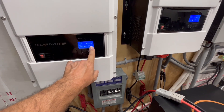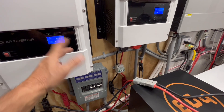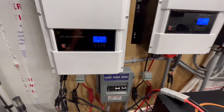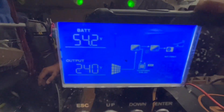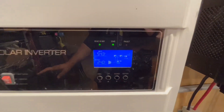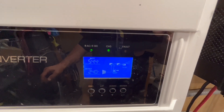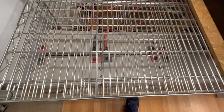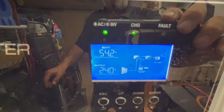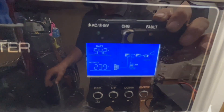It'll take a few seconds — maybe five or six — and the fault code will clear. The next time it starts up, it'll go from about 56 volts down to 54 or 55 when it starts. When I use those AGMs down there, it goes from 56 down to about 51 volts on that initial inrush, then quickly goes right back up to 56.